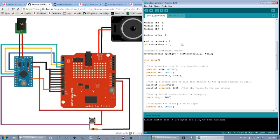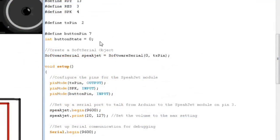This is why we actually use defines in code: if you need to make a change like this, you only change it in one location, and then it propagates everywhere through the code where that symbol gets used, and then you don't accidentally miss one and find yourself introducing a bug someplace into your code.